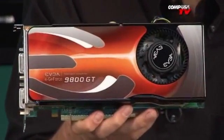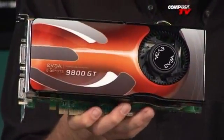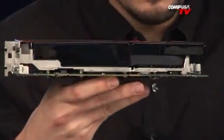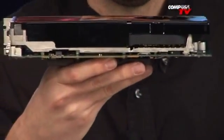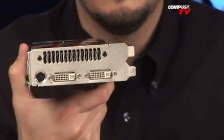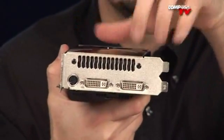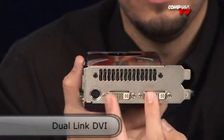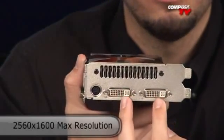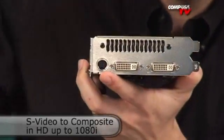Let me give you a quick preview of the board. It's pretty. This might not be the final sample — it's a brand new card, so it might say Akimbo in the future and have a slightly different design. But you can see all the cooling in there — bigger heatsink, bigger fan that flows heavier, dual slot, big grill up top, and fins all in there, which you don't see even on dual-slot 8800GTs. As usual, you have two dual-link DVIs that will do 2560x1600 maximum resolution. You also have your S-video output, which people call a TV-out, since it's mainly meant for TV.